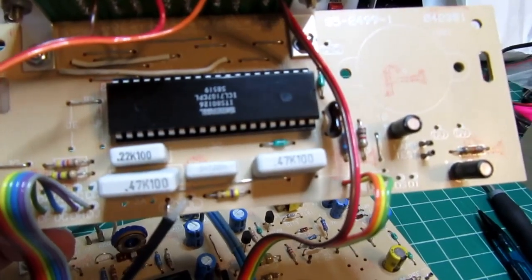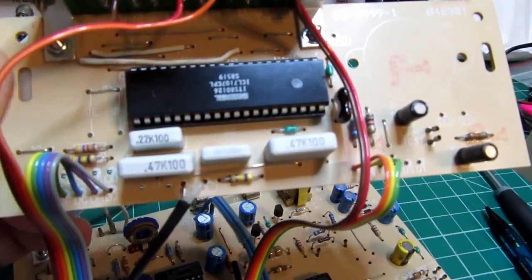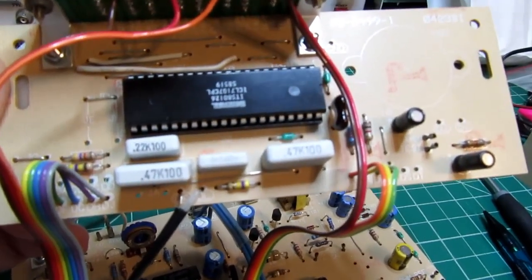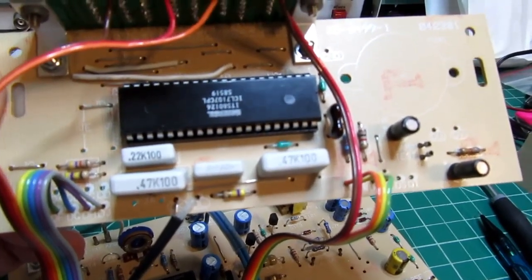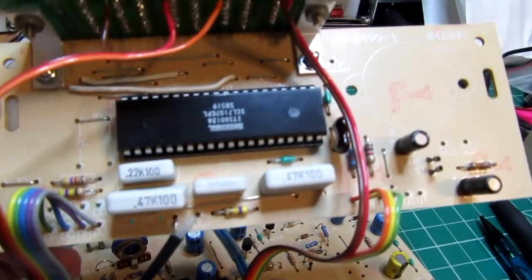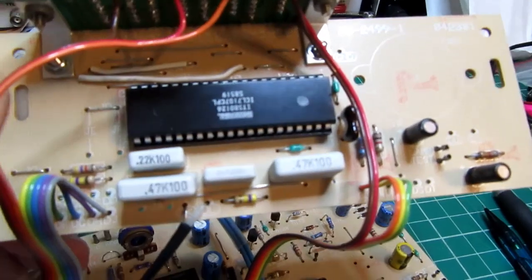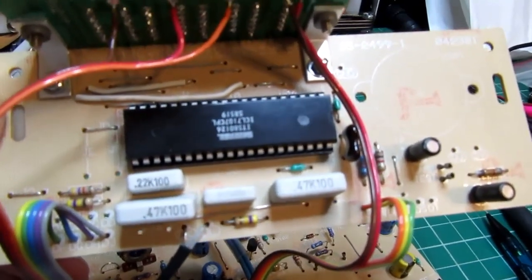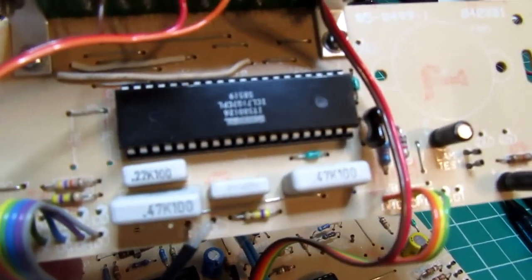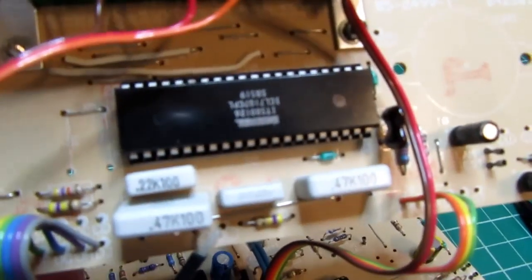monolithic analog to digital converter and display driver IC. That's a very ubiquitous part. It's the LED driver version of the ICL 7106, which is intended to drive LCD displays. I think the 7106 is the slightly earlier chip, being a slightly modified version of the original Fluke 4290-100 chip that Intersil designed in collaboration with Fluke. So I'm gathering that they came out with the 7107 slightly after they had success with the 7106, but I'm not sure of the timeline. Anyway, that's what that is.